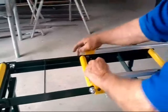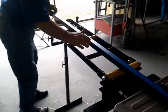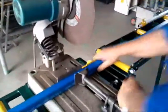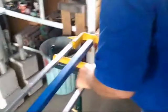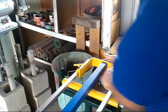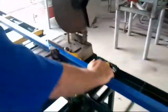When you're cutting your rail, say you want to cut some 8 feet. Well, you mark your 8-foot mark on here. You go up to where your 8-foot mark says, and you clamp it, right. That's what you want to cut it, lock it up, slide your gauge. Have I got these tight? Slide your gauge back. And there you go. You can cut them, like I said before, without even having to tighten the vise. Just slide them through, hold against it and bang.